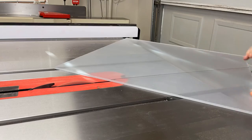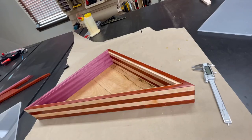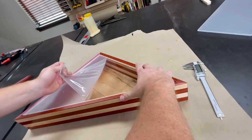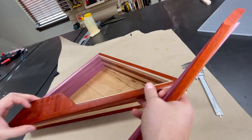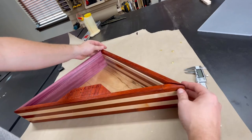The last step in this process is to cut the plexiglass — similar to how we made the triangle backing — and then secure it in place with the molding. Once I arrange the molding in place, I secure it with some 18-gauge brad nails. About two to three per side will do just fine.